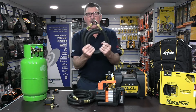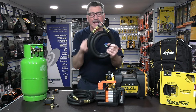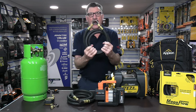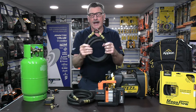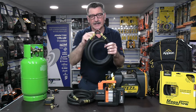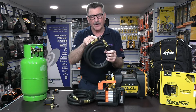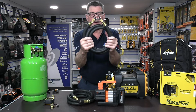Now, when we say 1/2 inch hoses in relation to vacuum, we mean the internal diameter. These big black hoses that we sell are 1/2 inch internal diameter to give you greater vacuum flow, okay? On the ends of them, with Appion, they only do the one hose, and it always comes with 1/4 on one end and always with 3/8 on the other, okay? They come with these nice little metal hose hangers included when you purchase it.